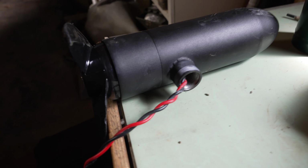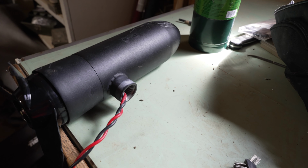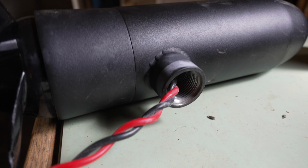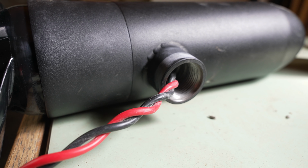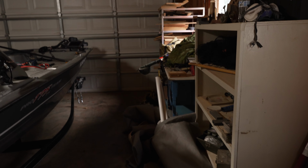All right, so this is like 2 days after where I just left off. My battery died, had to do some other stuff, didn't get down here yesterday. So anyway, the other day I got the shaft out, it was threaded. It took a lot of heating with a propane torch to get it to come out of there, and now I've got to clean the threads up and then put on this new piece of composite. But the thing about it is, this thing is put in with Loctite red. It's meant to be in there pretty permanent.